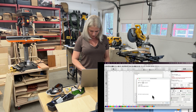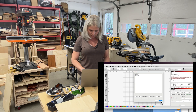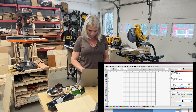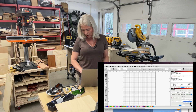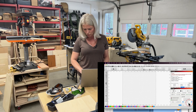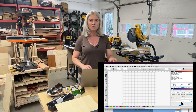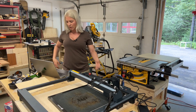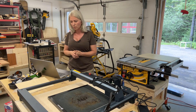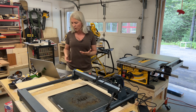Everything is looking good here, just click Finish, and I will say Okay. Now over here in LightBurn, you see I am still connected to my 10 watt, so I have to click on this window and choose my 30 watts. Make sure you are not on Bluetooth because I am not using Bluetooth. You can see my laser is homing right now, and that means we are connected to LightBurn. Now we can go into our settings, personalize this, and make it work the way we want it.